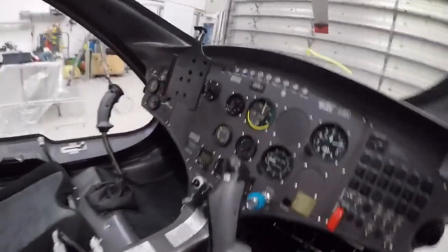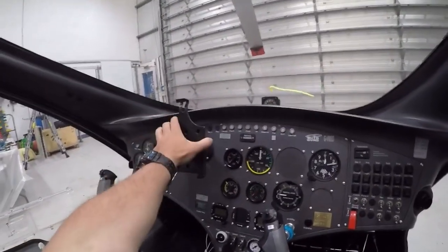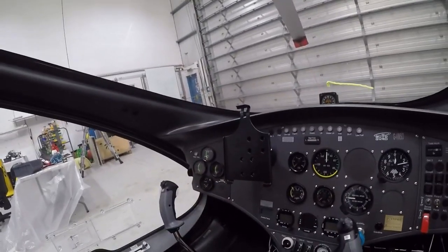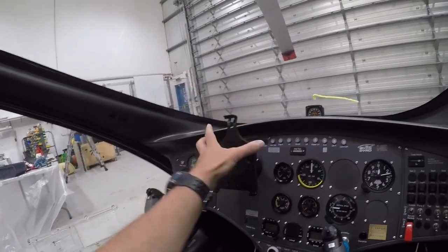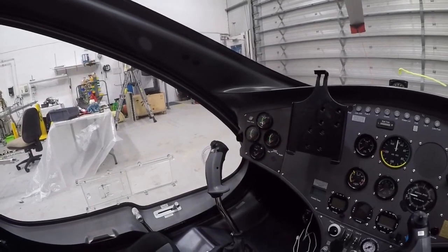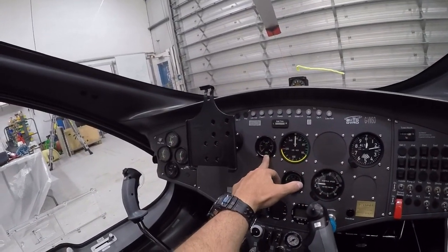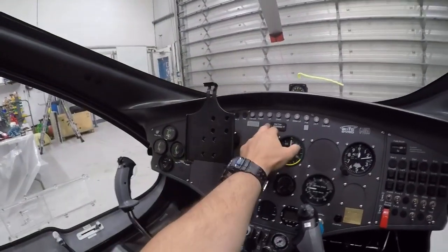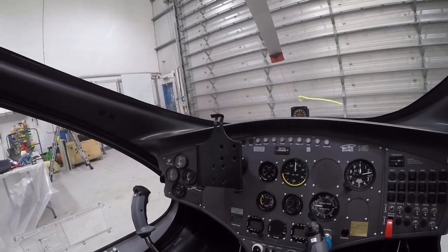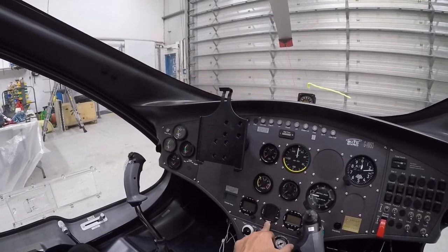The dashboard has a reasonably familiar layout for Autogyro products. One criticism is the iPad or tablet device mount: if the tablet is presented in landscape orientation it hides all of the engine T's and P's, which is a poor arrangement since those instruments are fundamental to safe operation. There's a fuel gauge, alarms across the top in the usual place, and a fuel flow meter specific to the 915 because the range of fuel consumption is quite wide. You've also got Lane A and Lane B alarms because the 915 has no magnetos — just dual channels through a single ECU.